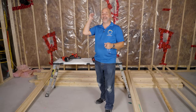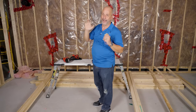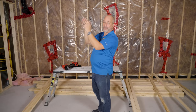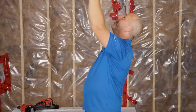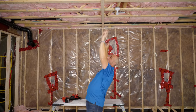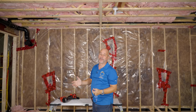The third reason I always strap is this: not everywhere are you going to get engineered floor joists, and not everywhere will they be perfectly centered. A lot of times mechanical chases and the way they lay out the house mean the joists are in different locations — two inches apart or six inches — so the drywall would never land in the right spot. By strapping, you install all your drywall in the opposite direction. When you're standing looking at the ceiling, it's easy to see where the screws go because you can see the strap on each side. That makes your life easy, and if you've got an easy situation to install drywall, that makes it a lot more fun.